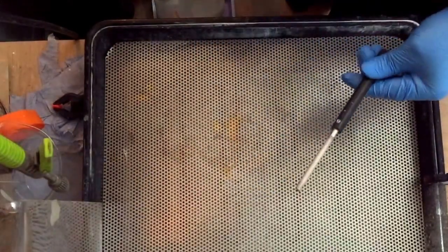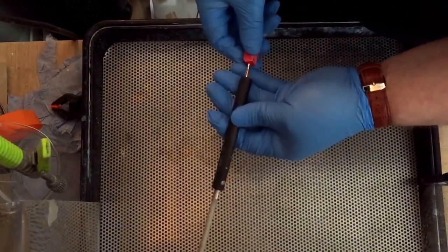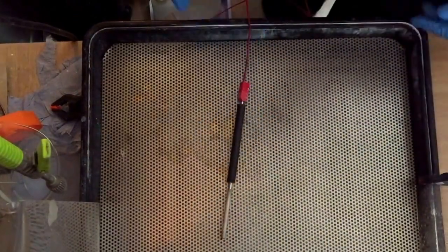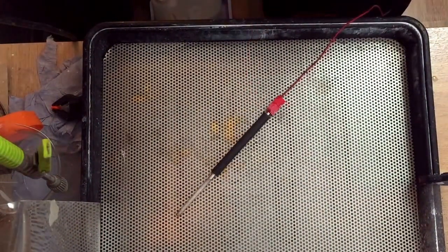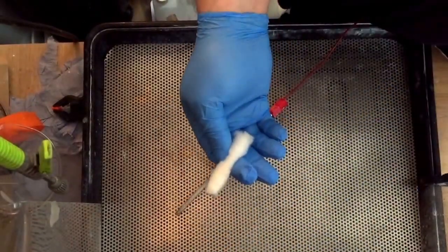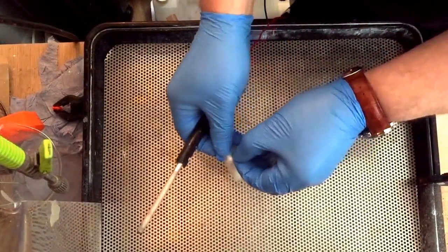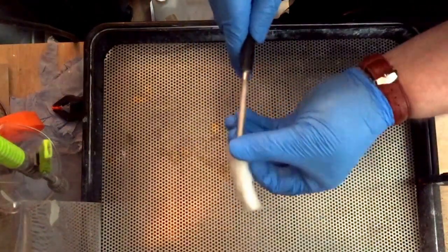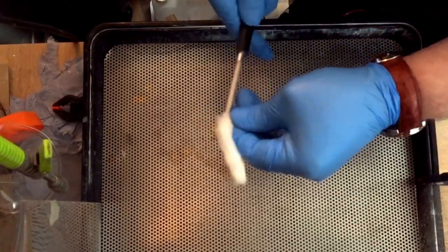This is the platinum electrode — not carbon, platinum. They last basically forever. Put the plus cable on there — always plus on the swab, minus always on the item. Putting the swab on is a little bit tricky with this electrode because the platinum electrode is quite rough, it's not smooth. So you must be careful. Once you've done it the first time, the next time it's much much easier.